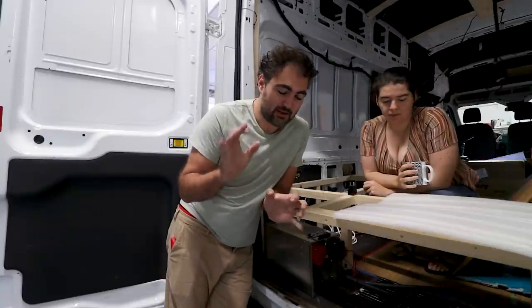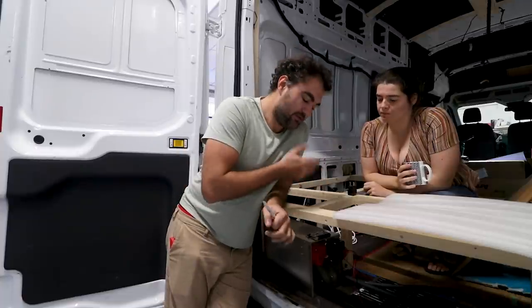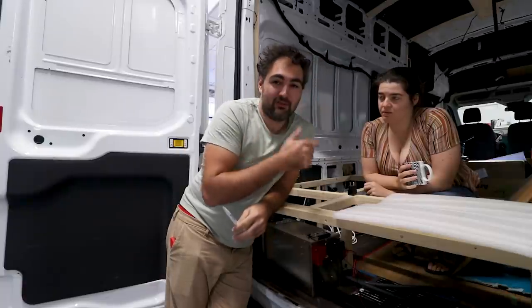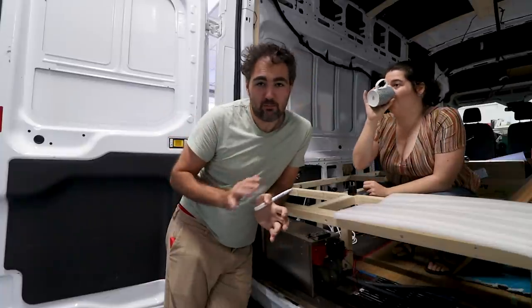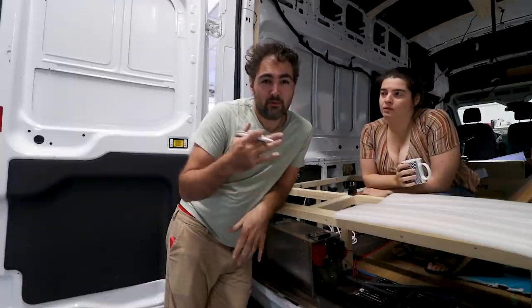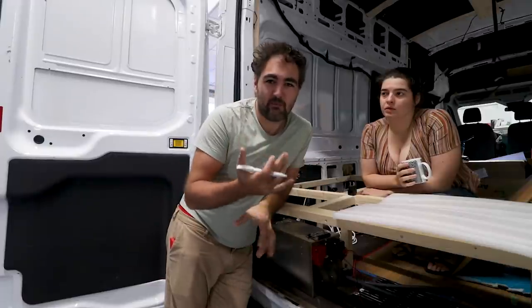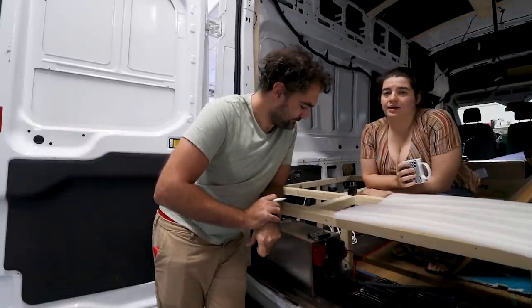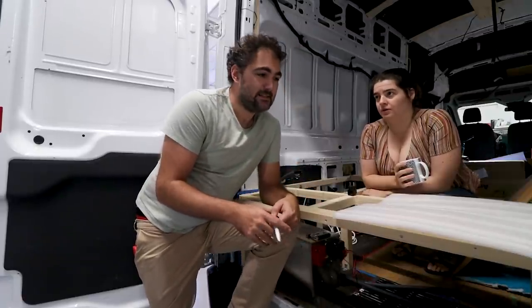Today we'll be installing our electrical system, which consists of a 12-volt circuit, where the battery gives off 12 volts. You can run your phone off that, you can run lights off of that, a bunch of things, which is really nice. But a lot of appliances only run on 230 volts AC. If you're in the US, that's 110 volts AC, but the principle is the same. You need high voltage for some equipment because our normal electrical appliances all run on 230 volts, like your laptop, a TV, the fridge.